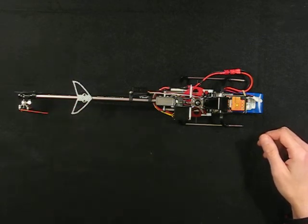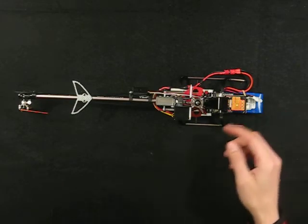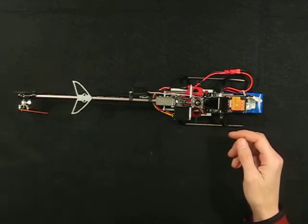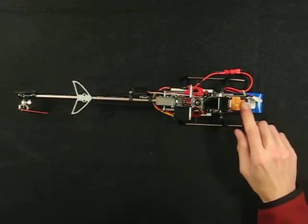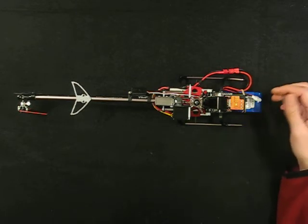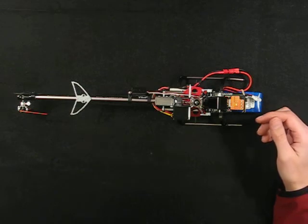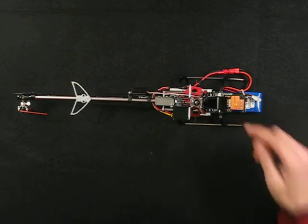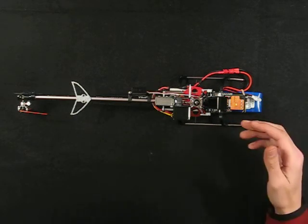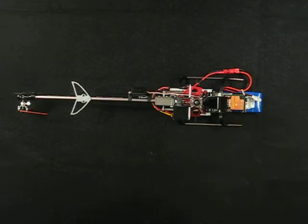And if you've got your servos doing what they're supposed to, let's go ahead and do the endpoint. You can just slowly move the rudder stick in one direction or the other to set that endpoint. When you get it set, the status LED is going to flutter and then go to a solid light. It'll either be blue or red depending on which direction you go first. The direction you start doesn't really matter. It's just a matter of seeing that color for each one. When it knows that you've gone both directions to set both endpoints, it'll tell you by turning purple. So let's go ahead and set these endpoints then.